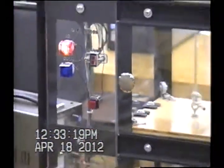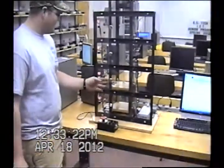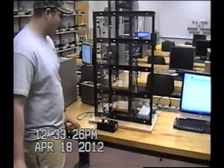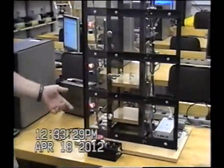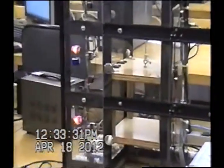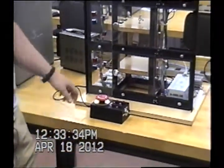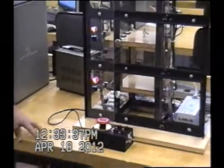We have safety features programmed into this. If we open a door, it won't run — that way nobody will get their hands caught in it. And if we close it back, it continues to process to whatever floor we called it to. We also have an e-stop that cuts off all the outputs if something goes wrong, and it resumes whenever we reset it.